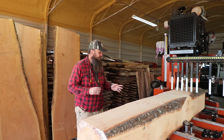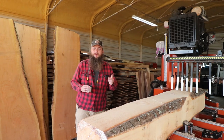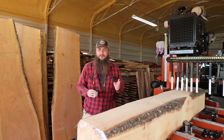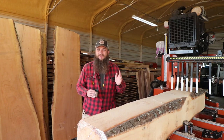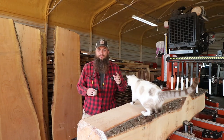So we'll do 1x10s on this one right here. We'll throw them in the tractor, take the tractor down to the timber frame. Also take the truck down because I got some OSB to put on for sheathing. We weren't sure about that, but the timber frame needs a little sheathing on the outside because it's racking just a little, because I didn't use knee braces on the top.